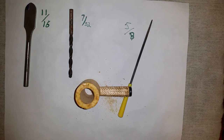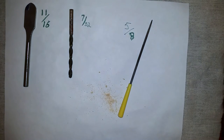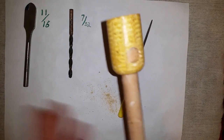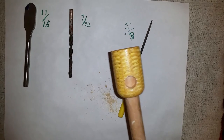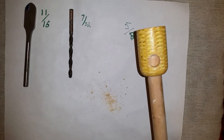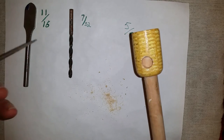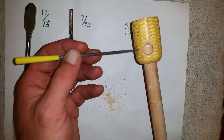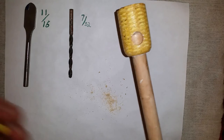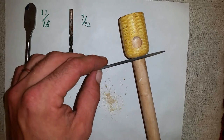Here's the cob on our stick. I inserted the 5/8-inch dowel so it goes just a bit above the top of the original hole. The reason I didn't remove the stem right away is that after you cut it out with the Forstner bit, it's a lot easier to wiggle out and you get a lot less breakout around the top. I'll let the glue dry for a while — it's a pretty tight friction fit almost by itself — and then I'll come through with a coping saw and cut the dowel off flush.